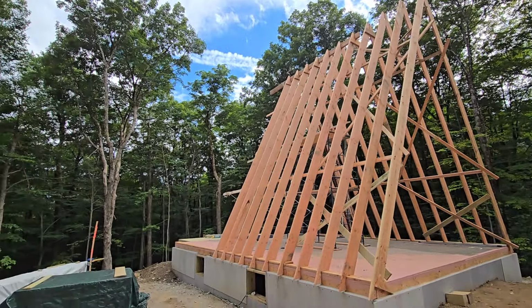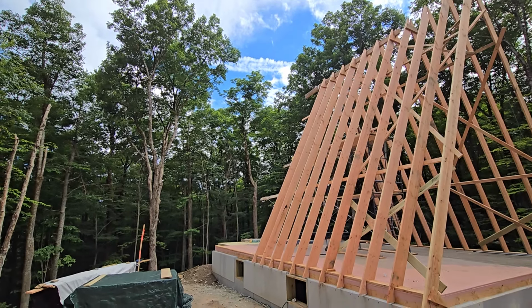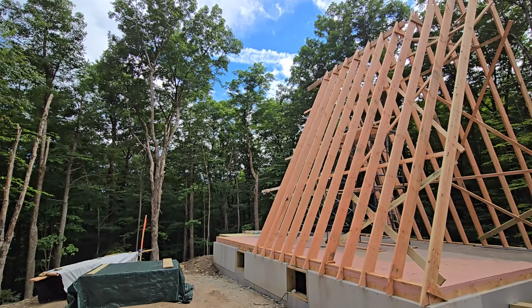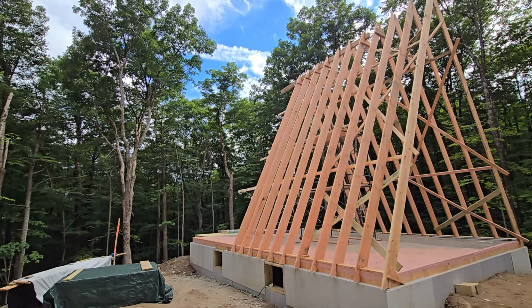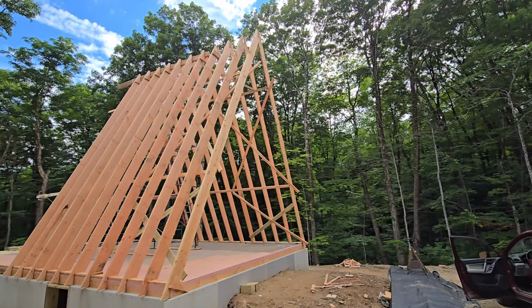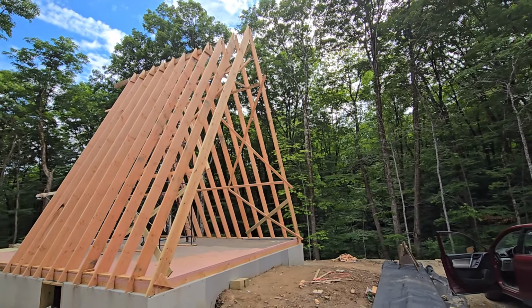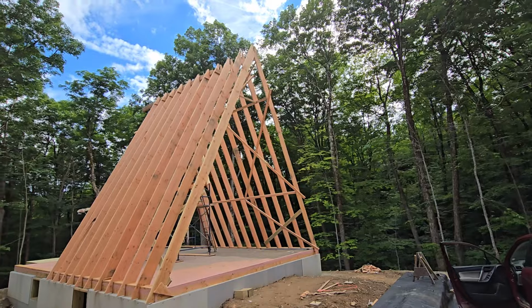When we get down the other end, it's going to be a little complicated because the top is going to have an 8-foot overhang out over the deck, and the bottom will be 2 feet out, so that'll create a nice little sun protection. It's being done for solar reasons. Winter light can get in, summer sun not so much. This end is facing north, so it'll be a different kind of view, but I'll give you a little preview.